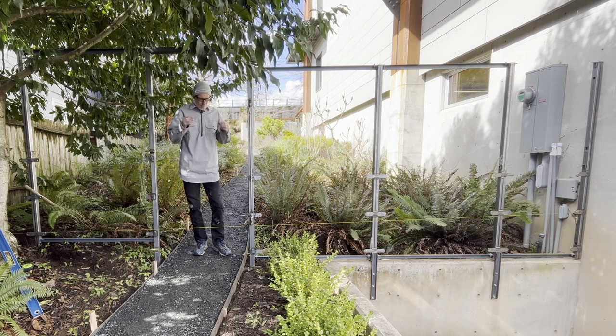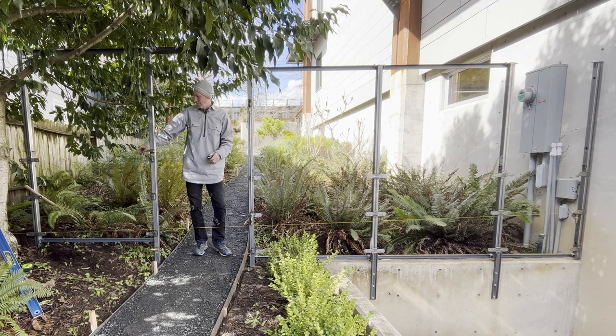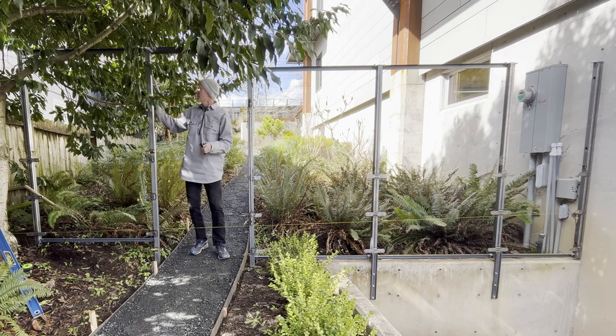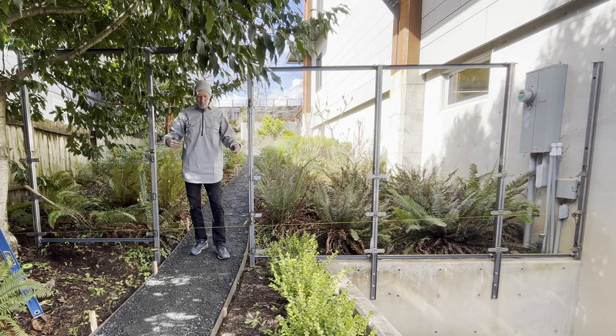Okay, so digging it out wasn't too bad. I was able to get the post put in. I had to go through a couple of roots, but nothing too crazy. I've got it sort of positioned. I've got a string line across here to make sure that everything's planar, and then it's level and sort of rectified. So I could pour the concrete, but I'm gonna go ahead and put the gate in and